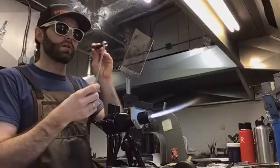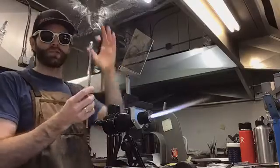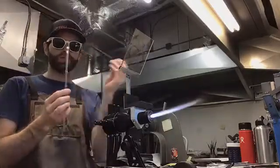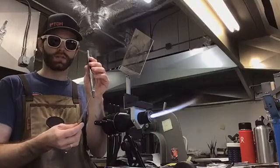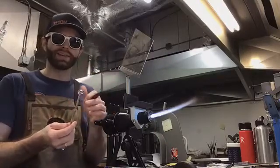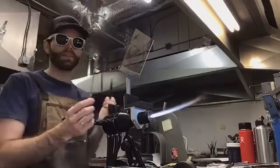Okay, you can see that peach glow. Going once from this side, flip it around, and once from that side. Really important to go in from both sides, otherwise you'll push it. And I always like to hold the loop right in front of me and come in at a 90-degree angle. If you go like this, you guys can see it from your perspective, but I can't. If I start pushing that loop away from me, I can't tell. When it's straight up in front of me like this though, then I can see if I'm pushing it off to the side.